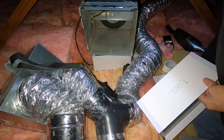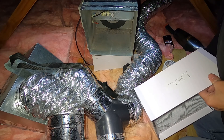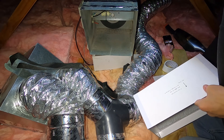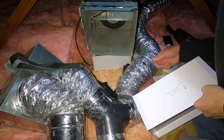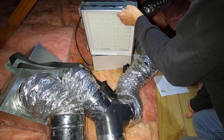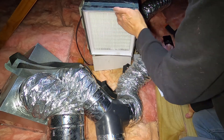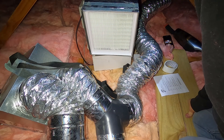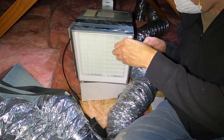The next step is to fit our air filter into the galvanized box — the air filter fits into the motor side of the box. The airflow goes from the motor side towards the ducting side, so we want to fit the filter in the correct direction to follow the airflow. According to the instructions, you'll need to tape around the edge of the filter so the air can only flow through the filter. We're going to start off by taping the top of the box.